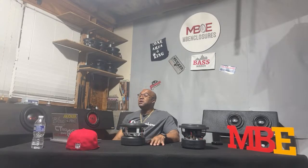I'm gonna tell you what the problem with your ZBX8 is. People ask me, why you ain't did the box on that yet? I done built 3 boxes for that joker. The TS parameters are wrong. The TS parameters make no sense. The program tells me each and every time something's wrong with the parameters. But based on what they're telling us, this is what we put out. And everything it put out is telling me that sub needs to be in a 2 cubic foot box.